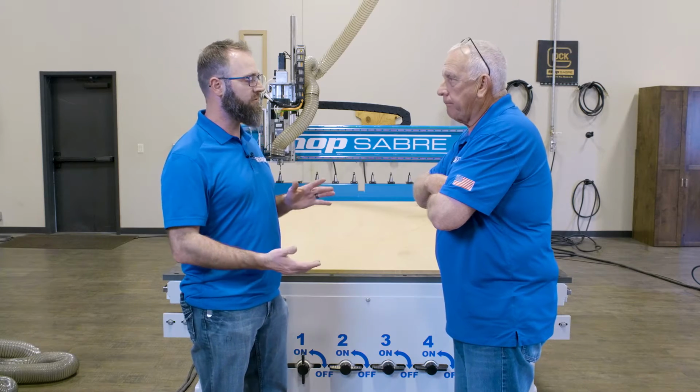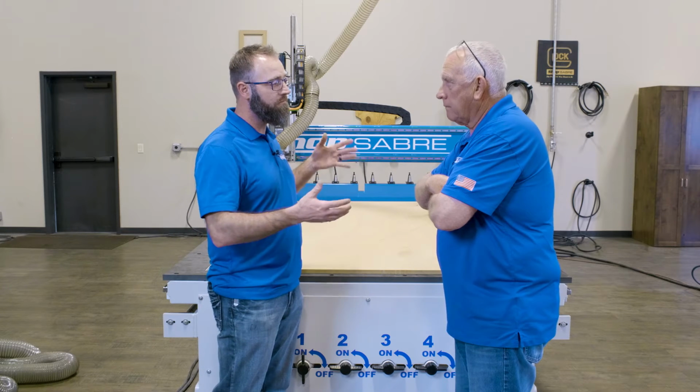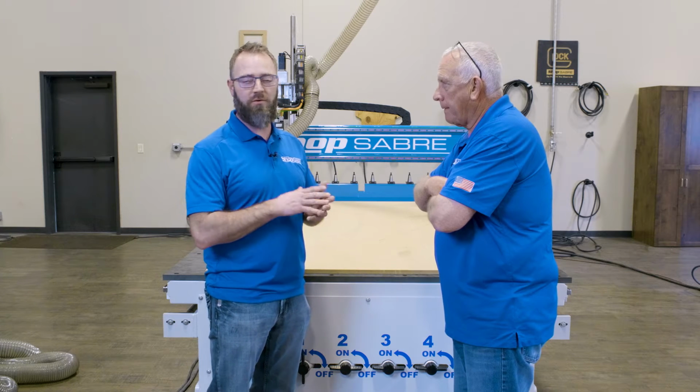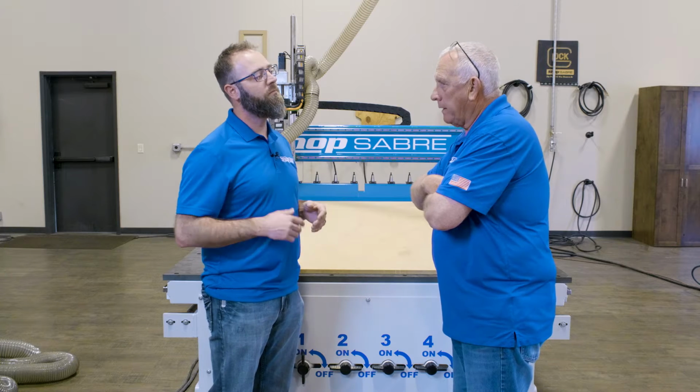Tell me the procedure. Well, we're going to start out, we'll flatten the slab, make sure it's good and flat on each side. That way when we set it into our box, I'm going to need you to get a box together to hold the epoxy in. I do have some 3/4 melamine we can use. We can do that. So if you can get a file for that, we'll make that happen.